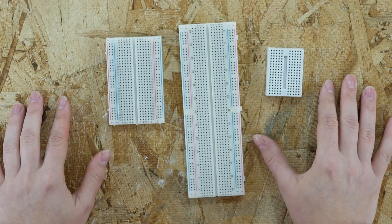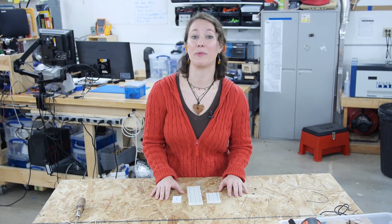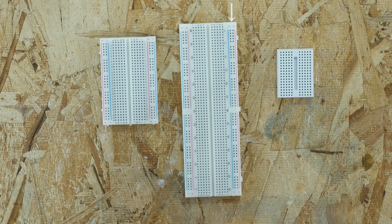The last thing I'm going to talk about are breadboards. When first building your circuit it's best to start by connecting your components on a breadboard. On the side there are two columns that are each connected — the negative blue column is all connected and the red positive column is all connected, and these are intended to be used for power and ground. In the center there are rows, most often with five holes, where all five holes in each row are connected. This smaller breadboard is simpler and lacks the power columns. Breadboards come in different sizes but they all pretty much function the same — get a size that works for your project.